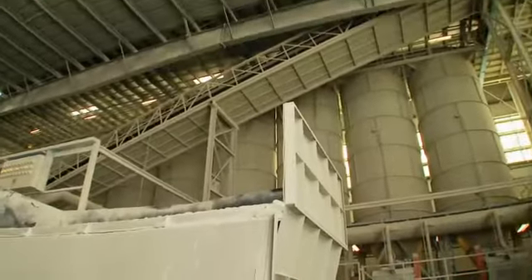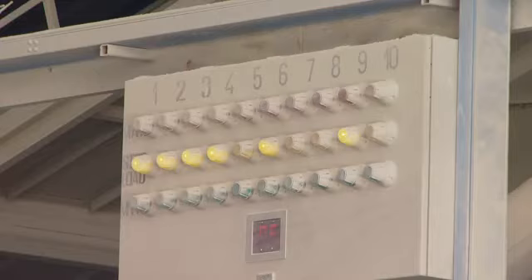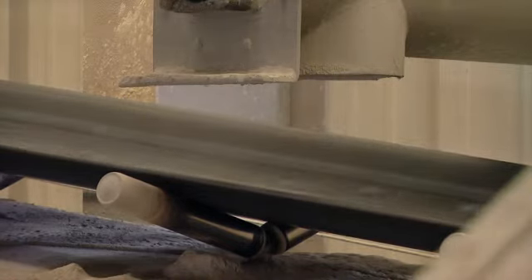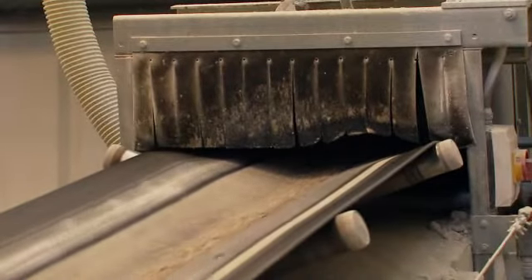We'll take the fired scrap here along with our other raw materials in the storage bunker, mix them together in our raw mill, and make the body of the tile. Here we are at the next step where we put all the raw materials together into our batch. One of the things we do when we bring the raw materials in is dump it into the hoppers you see behind us. The computer will then put the raw material into each individual silo — each raw material has its own holding silo. The computer then creates a recipe of sorts, blends that material back onto the conveyor belt, and that material is taken out to our ball mill for further processing.